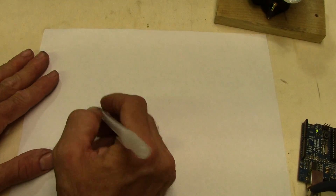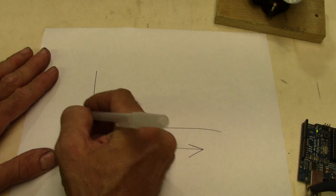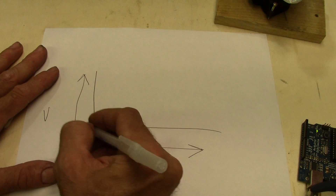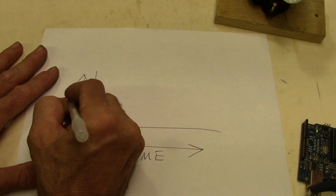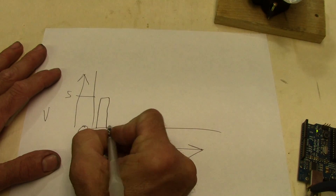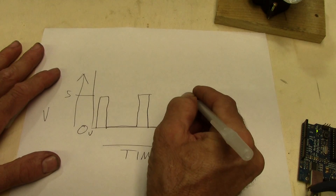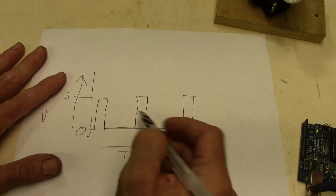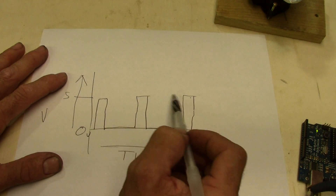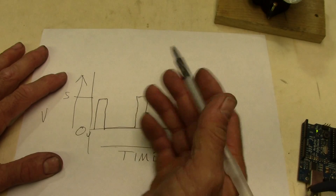Quick explanation of pulse width modulation — let's draw a little graph. This is time, and this would be voltage. This is zero volts, and let's call this five volts. If you want to drive the motor at medium speed, you would send a pulse, pause for some time, send another pulse, pause, and another pulse. During that span of time we've only got three pulses of voltage, so the motor is only getting a little bit of voltage — just those pulse durations added together as the total time it's actually getting driven.